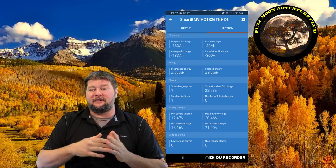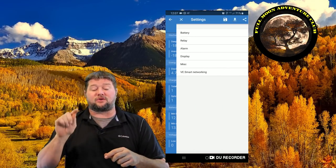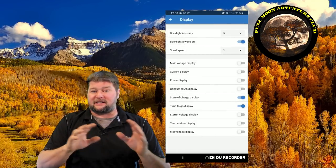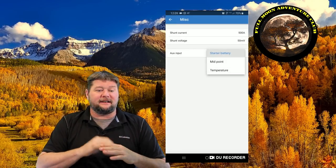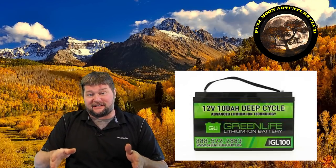The Bluetooth app is great — I highly recommend it because you don't have to scroll through settings by pushing the plus button on the physical monitor. Setup is straightforward: enter your amp hours and fill out a few settings per the manual and you're ready to go. What I love most is having an accurate percentage readout thanks to the battery shunt, which measures the current going across it and gives a very accurate reading of amps in and out and actual battery voltage — crucial for lithium-ion setups.